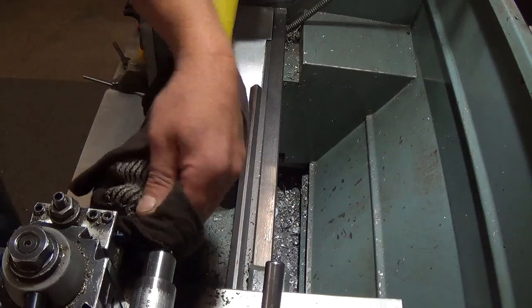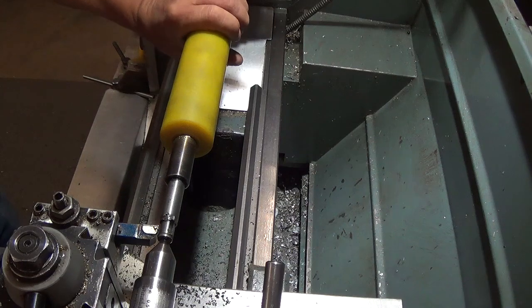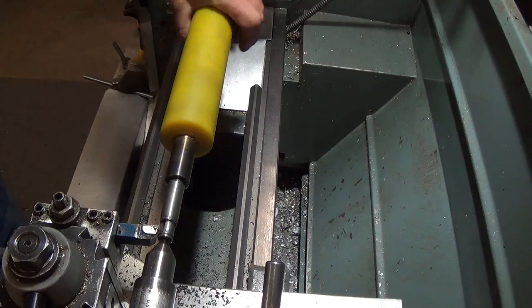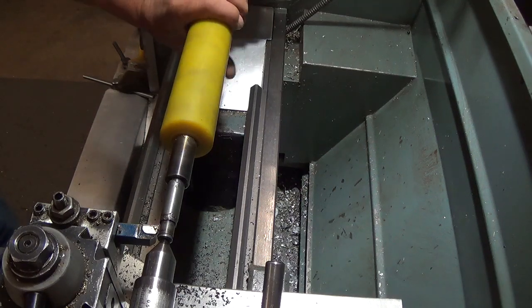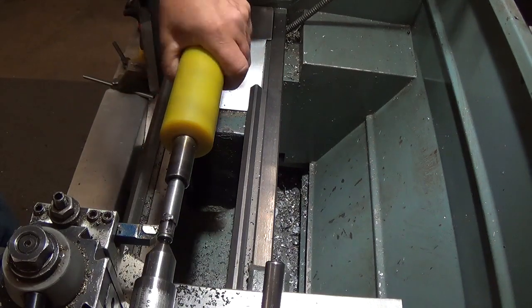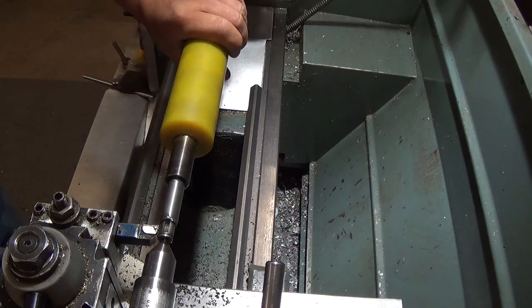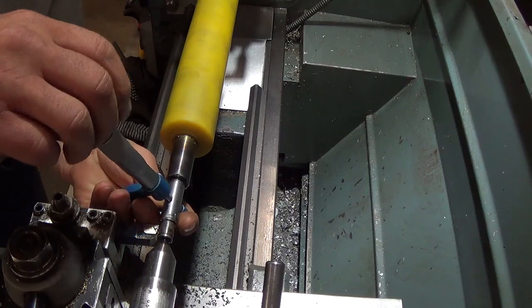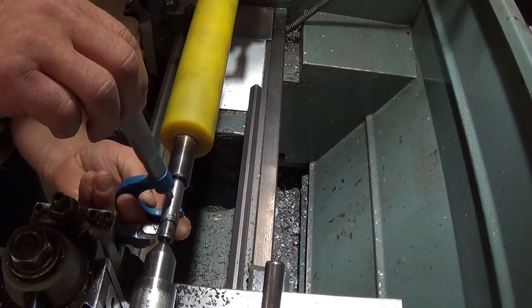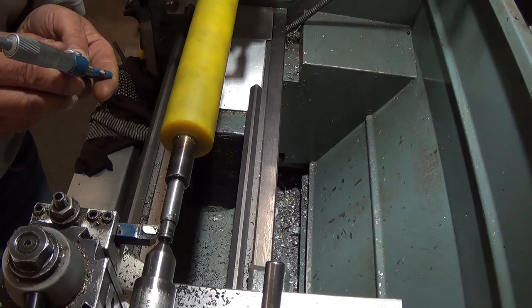See how we're doing here. And one small holiday there, but by the time we get down to our bearing diameter, that may be gone as well. Our weld on the end is a little bit shy, but I really didn't want to get into this keyway because I didn't have a cutter to recut it. Target on this is 549.5 to match the other end, as we use the same bearings on both ends. Right now we are 580.